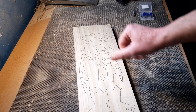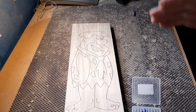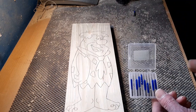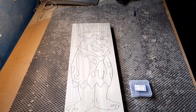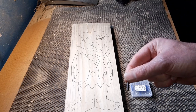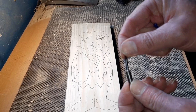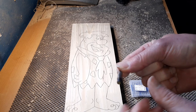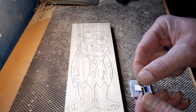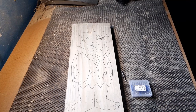Before that we'll get a scroll saw and cut it out to shape. You could leave it on that piece of wood if you wanted. Now, as always, I like to use CNC bits — normally end milling bits to route out areas, but today we're just doing the lines. These come in different degrees — these are 20s and 30s, you can get 15s, 10s, and I believe there's a 60 out there. They have a Dremel-size shaft of 3.175mm, so they'll fit a Dremel no problem. If you want to use a Dremel router attachment instead of a full-size router, you'll need an adapter collet — 6.35 millimeter — that slots in there. If it's a quarter-inch router, these adapters go up to half an inch. Then we'll just go around all the lines.